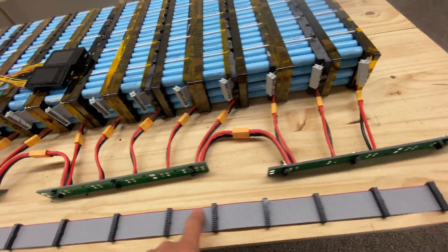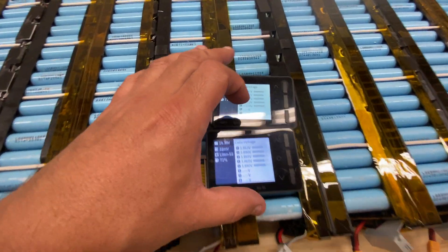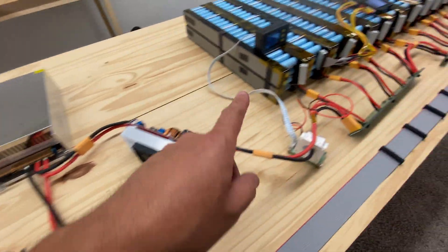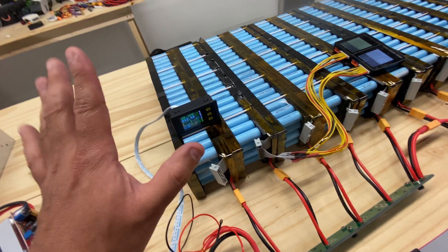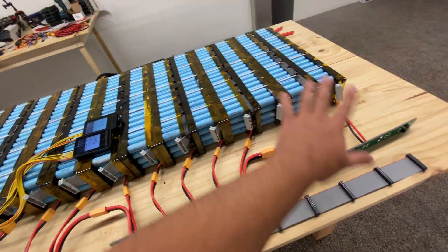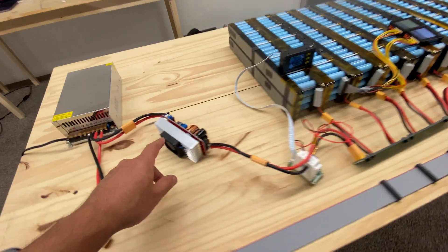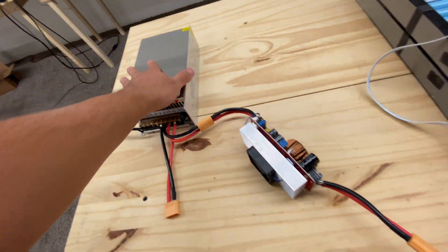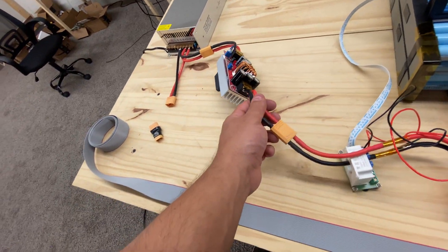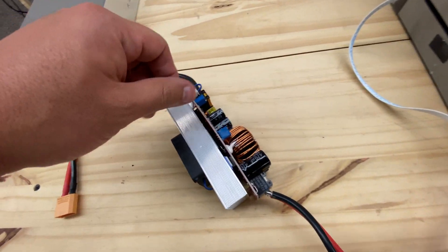I'm waiting to connect this. I didn't want to connect it here because I made this little thing to check them. They're not all perfectly balanced. They're all around 38 volts right now, but some were a little bit less — 37 — and I think one was like 39. There's about a two-volt difference between all these packs. So I connected them first, let all these voltages average out. Now that they're all connected together, I'm using just a 24-volt power supply with a DC-to-DC charging converter. It's got constant current, constant voltage settings and little pots in here.